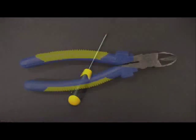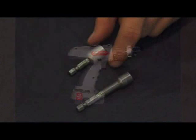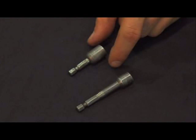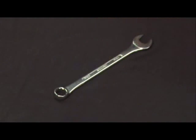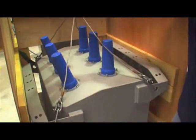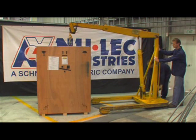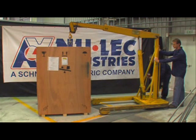In order to unpack the recloser, you will need a large screwdriver, side cutters, a ratchet wrench or battery drill with 5/16ths of an inch and 3/8ths of an inch sockets, a 16mm spanner, a 16mm socket, 4 D-shackles, and to lift the recloser, 2 slings and a crane with a safe working load of 300kg.